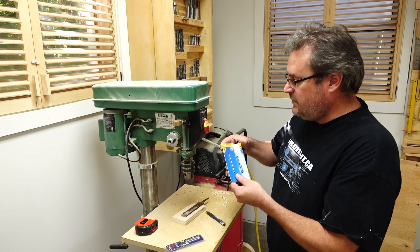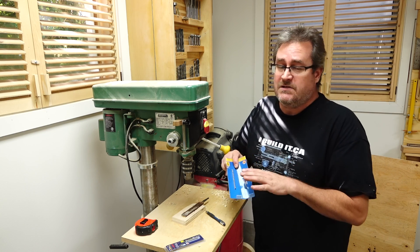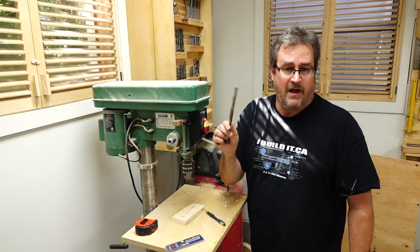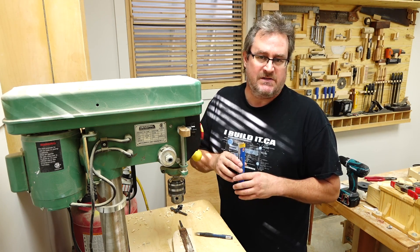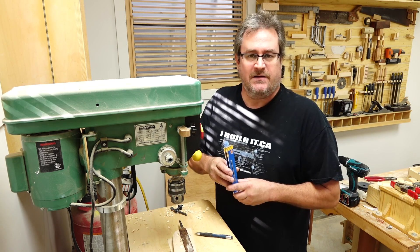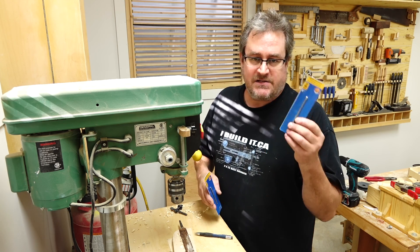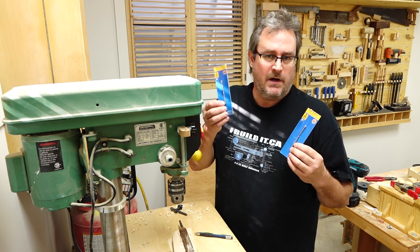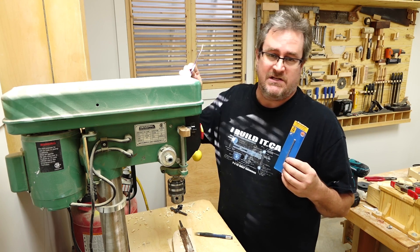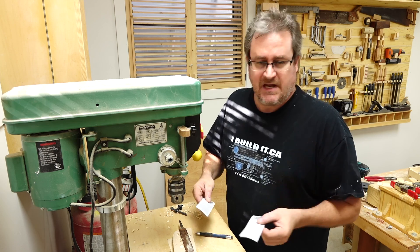I went out this morning and bought two new bits. These are identical — 3 sixteenths of an inch. I intend to use them right out of the package; I'm not going to sharpen them to drill two holes into this broken-off file. Most of the comments were for slowing the speed down. I did get one comment from a viewer with a lot of practical experience who said you should actually drill faster and do it dry. So I'm going to try fast and dry with one bit, and slow and lubricated with the other — I'll just use oil again, but slow the speed right down to as slow as this drill press will go.